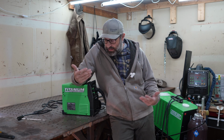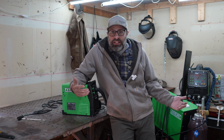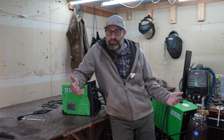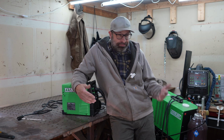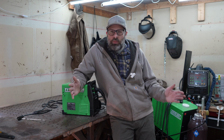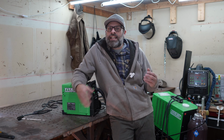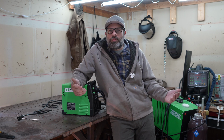I would call this thing a lawnmower fixer. This thing just fixes stuff. You need to weld something that broke up to, say, 3/16. Normally 125 amps, 0.125 is an eighth. That's how you usually do it. But this thing will do 3/16.